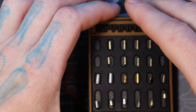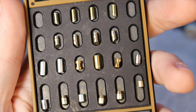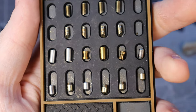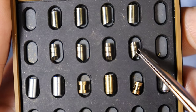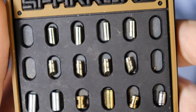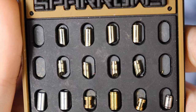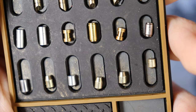What's interesting about those pins specifically is the bottom ones, on the bottom part of the plug where the key pins are, those four holes to the left there, all of them have some serrations, it seems. So a little bit right there, right there, right there, right there. And I'm not sure if that's a security feature. It looks like it is, because that one has 1, 2, 2, and 1. So I'm assuming it is, but you don't really feel that at all, because you're just picking the normal key pins. These don't really have too much to do with it.